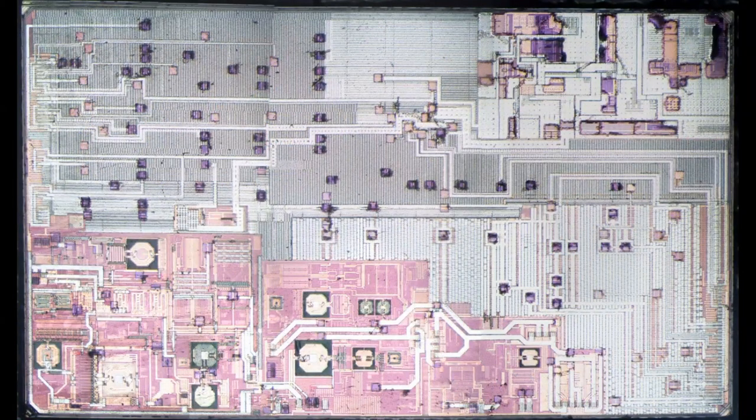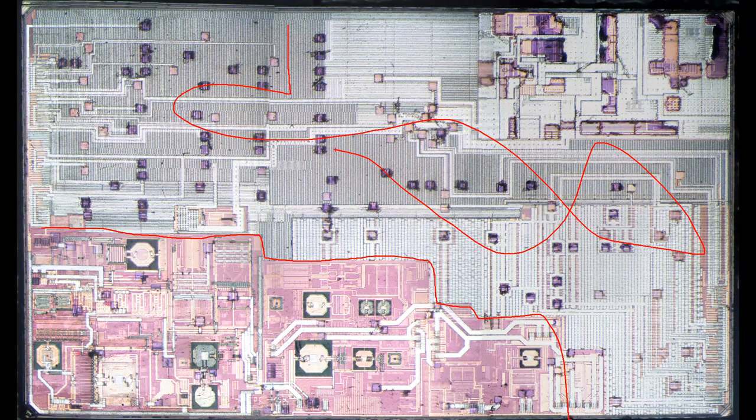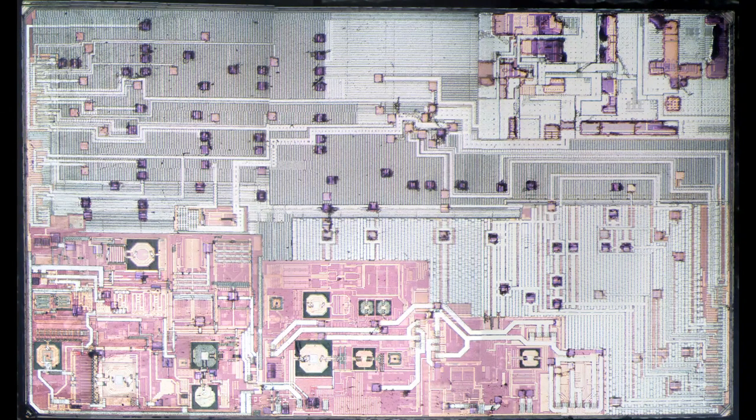I put the part into acid and stripped off what's known as the primary side interconnect. Now we can see a section in pink, which is the RF component tree. The parts in silver are basically power connections, and below that there's even more semiconductors. Most of this is going to be digital logic or low-speed analog. The more interesting part down here provides the actual Wi-Fi function. These little hexagons are coils — here's an impedance matching coil. There are basically two blocks in this chip: one for Wi-Fi and one for Bluetooth, although I believe this particular assembly has Bluetooth turned off.